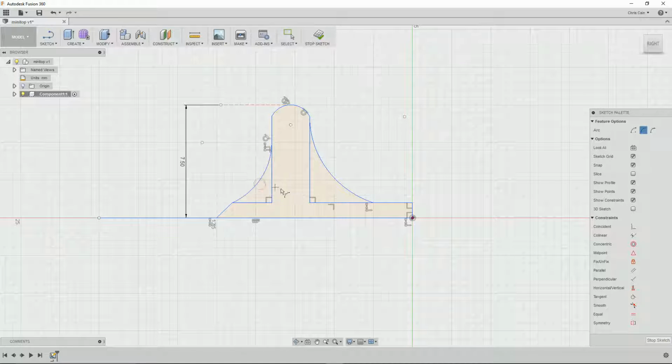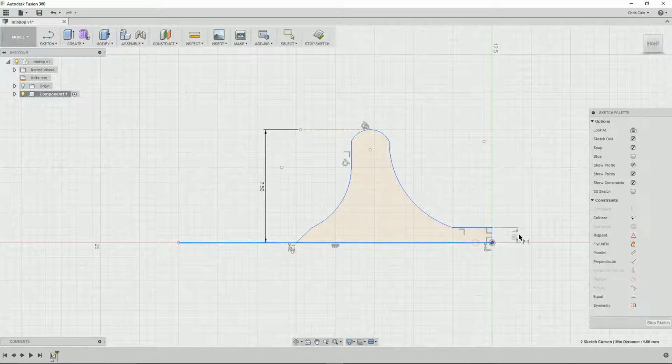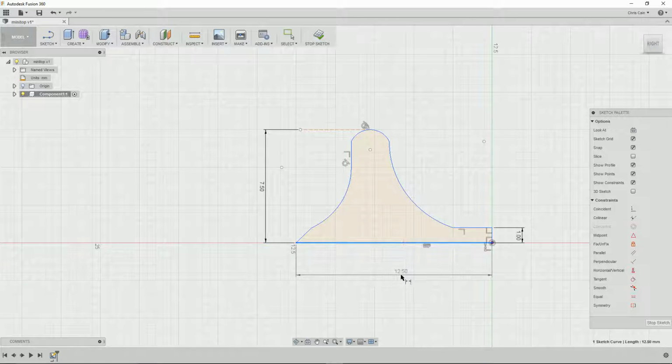Notice that we're designing half the top here. We're going to spin it around the centre line to give a solid. Because we're going to spin it around the centre line, we don't want any internal details which would mess up our revolution solid. Put in a couple of dimensions. Shaft's going to be 2mm, so half of it's 1mm, and the top's going to be about 50mm long.